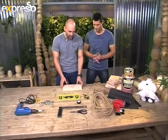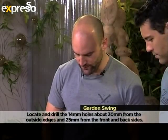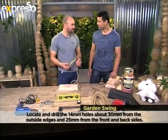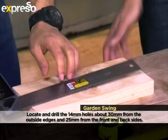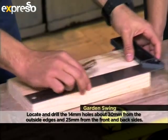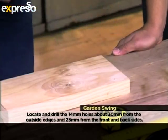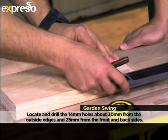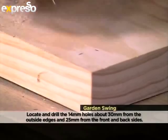You're going to lay a piece of timber down. So obviously now we have to cut our holes. What we need to do is make our holes in our wood big enough to accommodate the rope. So with your set square, you want to measure it up on the corner. You just take it to the zero side. And as you can see, you want to place a measurement there at 30 and then transfer that across again — 30 there. And then do it the same. So now we've got a nice center mark.